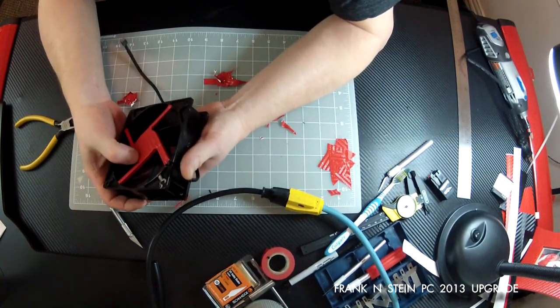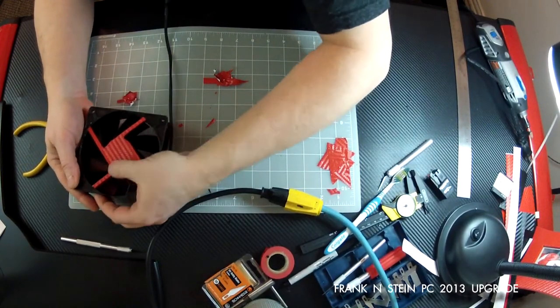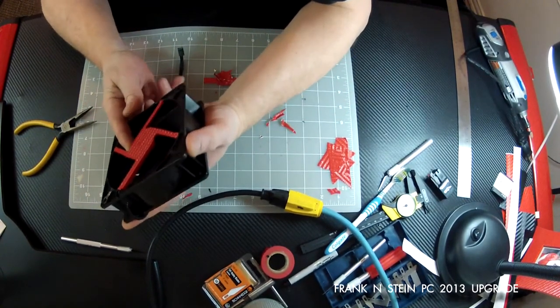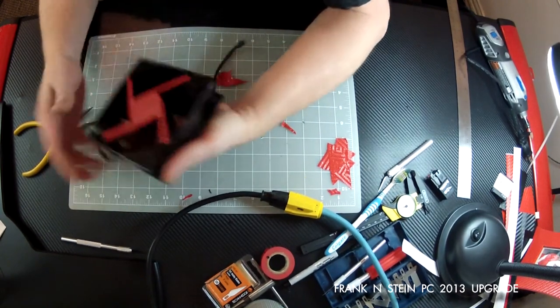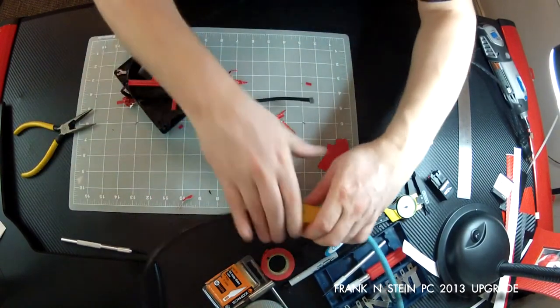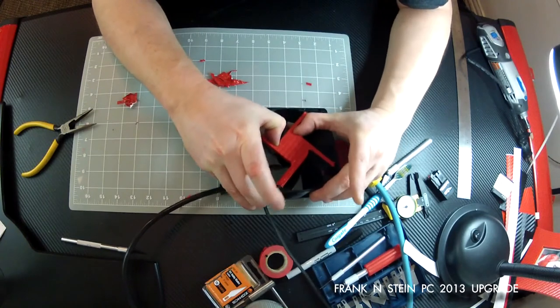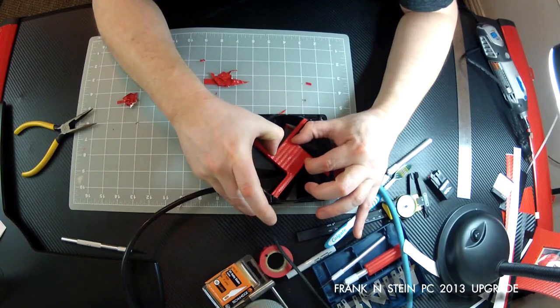Now that I've got it basically done, I was trying to work on those little curves and get a little crease out that came up around that curve. It takes heating it and forming it repeatedly — you just have to work it. You've got to work that carbon fiber right around to the point that you want it. What I've done here is heated it up and now I'm going to put my fingers into these little curves and let it kind of harden right there. While I'm holding it, it's cooling off and shaping itself to those little curves.